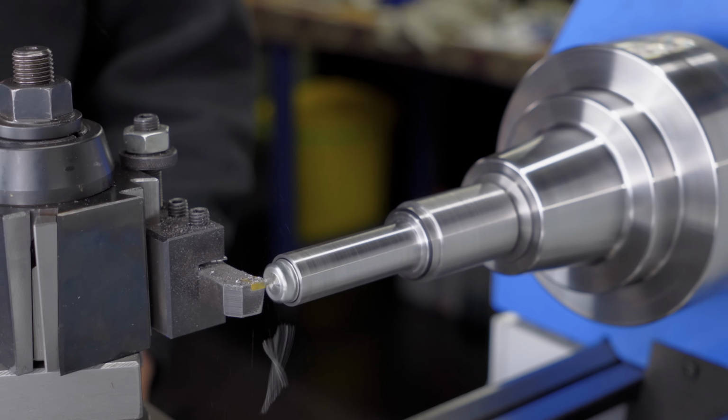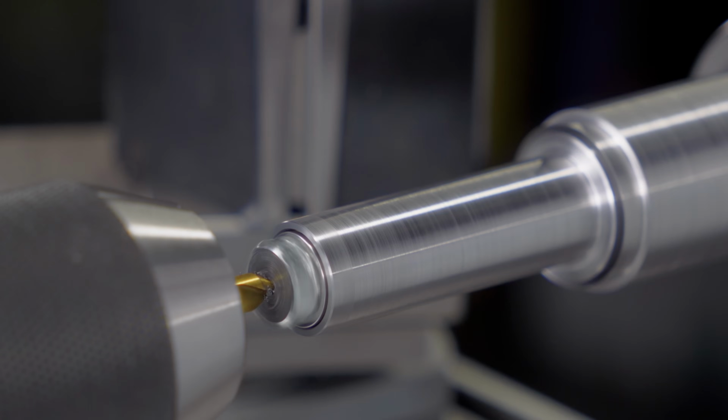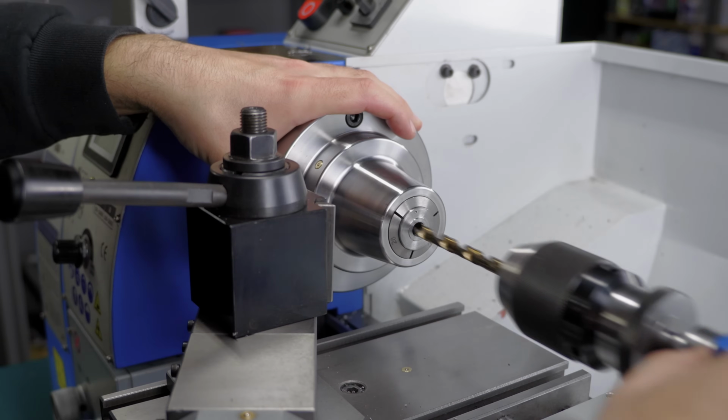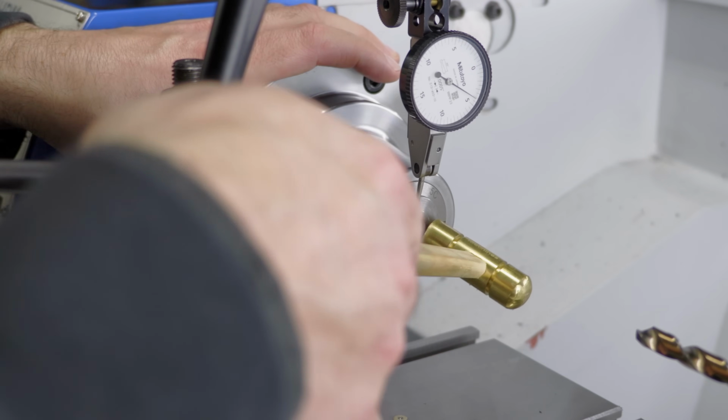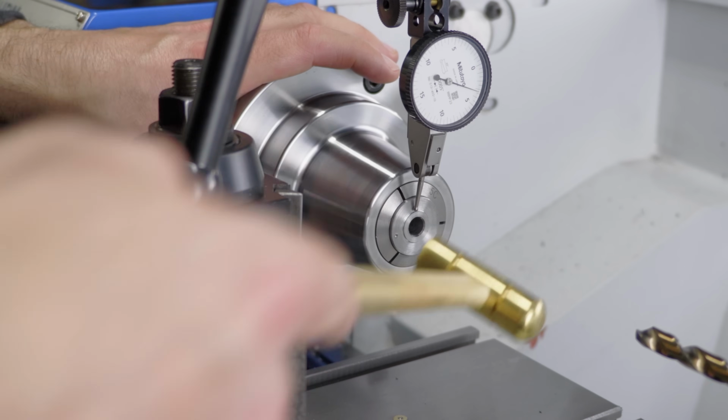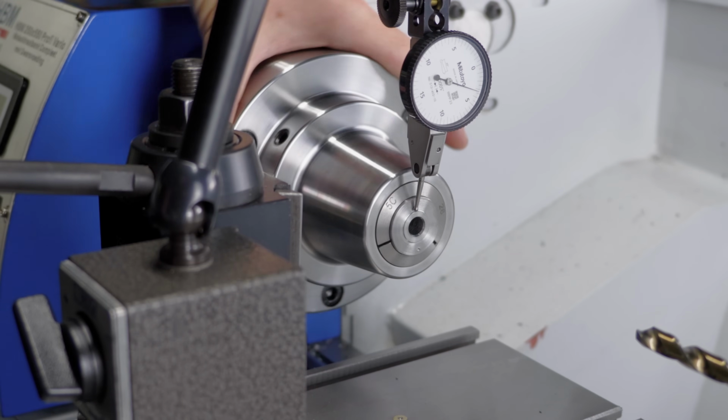And finally, I'll drill the second center directly in the bolt's head. And that completes the roughing of the first cap. Back to the second. Now I can hold it in the chuck and indicate the face cut in place, to ensure the recess for the bearing is cut square to the tool's axis.